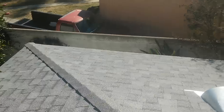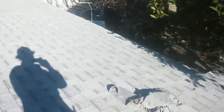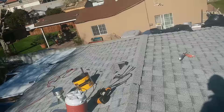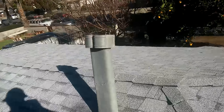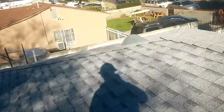You can do it your own way, but I think the ridge is the most important thing on the roof because everybody's gonna see it. Nobody's gonna see your crooked lines underneath. This is a little tiny job I did in Duarte, California. I'm done with the ridge installation - this is the way it looks. I also cut my corners where the first shingles are. If you don't cut them you get the ears dropping down and it looks ugly - not now, but in years. These are tips that'll make your finished job look better.